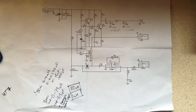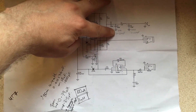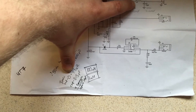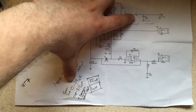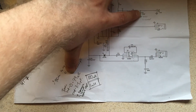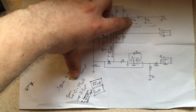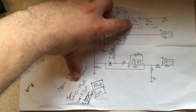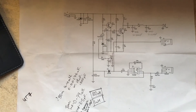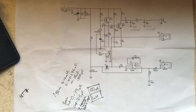Here's the standard bit of paperwork that you'd get with your Pixie from China. I've been having a play about and trying some different values in the capacitance based on some calculations I was doing. But ultimately for 30 meters we've ended up changing the L2 inductor over to 0.79 micro-Henrys, or as close as we could get with the bits we had, and we've changed the capacitance here and here over to 315 — the optimum value. I've gone with 320, using a 220 picofarad and a 100 picofarad capacitor in parallel. So far it's working really well. I haven't made any contacts with it yet on the indoor antenna because we've just got a wire going around the shed while we're doing the tests, but we'll be taking it out and trying it on the vertical antenna a little bit later this evening and I'll maybe do some more video of that as well.